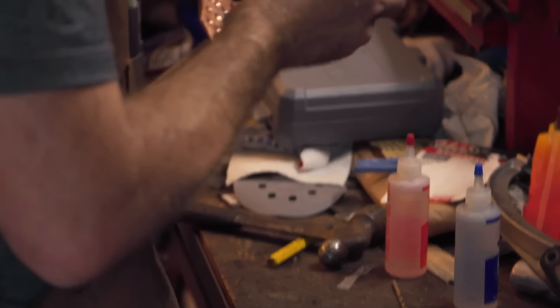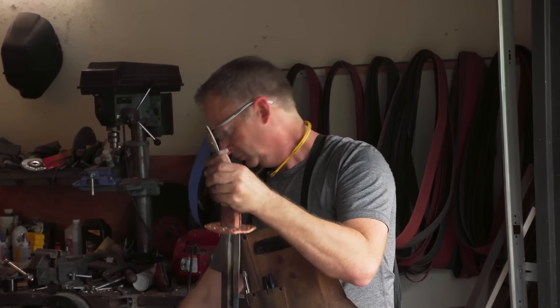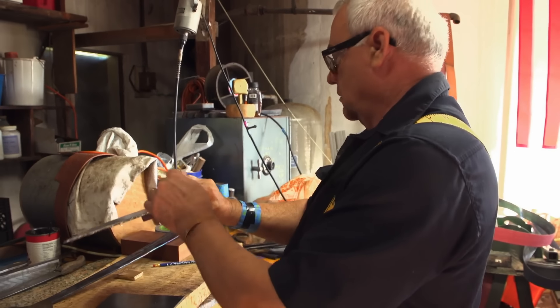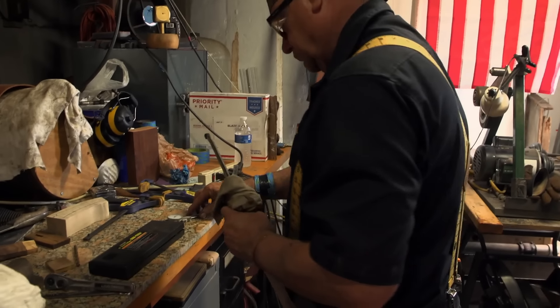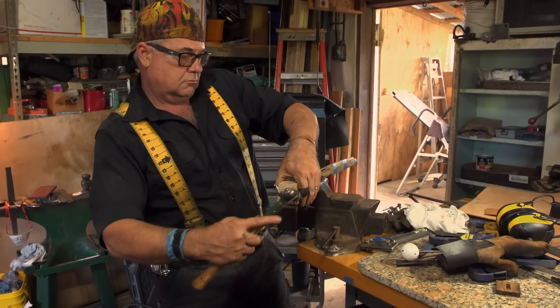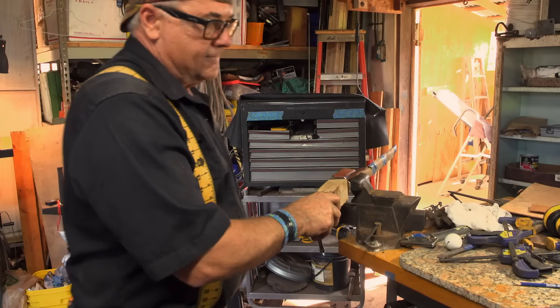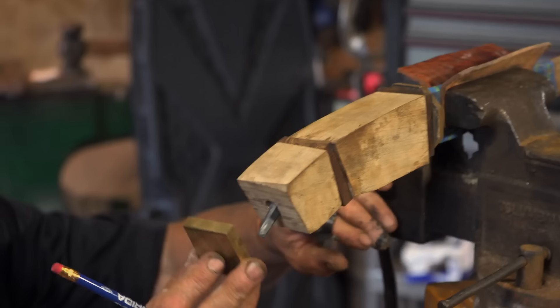Round two. I also have to fix the butt cap that I messed up trying to press it into the tang. I have to change my game plan and attach the butt plate by epoxy. I'll be able to get a handle on the situation. I'm going to figure out the handle design — the finishing of a weapon is the most time consuming; this is tedious. I've got a curved tang to deal with, so I decided to cut the pieces up. I put the handle together doing a dry fit — my angle's way off. I'm going to bend this tang just a hair. I really thought I'd be further along, but I think I'm set up good for tomorrow to finish.